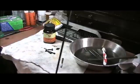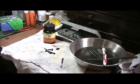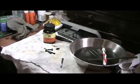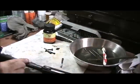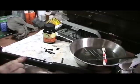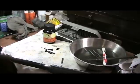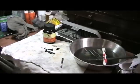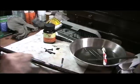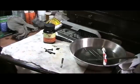But first of all, I'm going to go over this barrel with some quadruple aught steel wool. And very sparingly, you want to dip it in your cleaning solution. Just go over it like that. I can already feel a difference just from that little bit that I've done there. The rust is already broken loose from the surface. I'm going to go over this whole barrel here, and then when I get it all cleaned up, I put a real thin sheen of mineral oil on here.